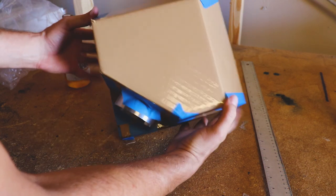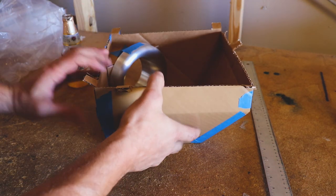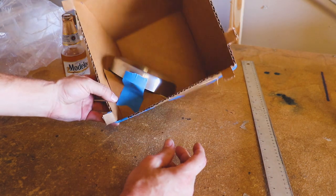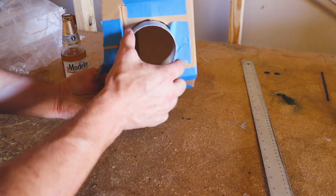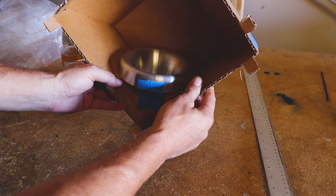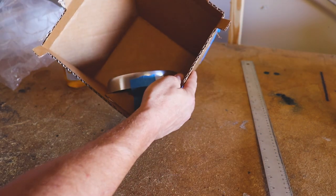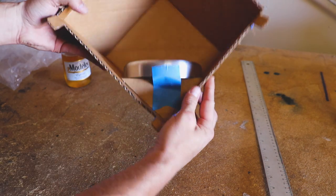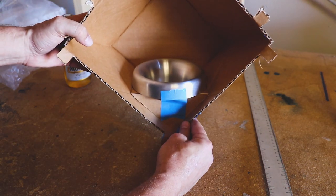All right, here's the finished mock-up. Here's the bell mouth I was talking about a little bit earlier — got it from Vibrant Performance, it's a 3.5-inch OD bell mouth. I think that should be sufficient flow for our turbo. Our air will draw a lot from the center of the filter. Let's go ahead and toss this on the car and see if we can close the hood.